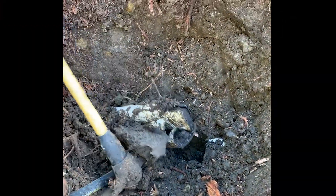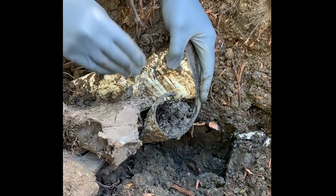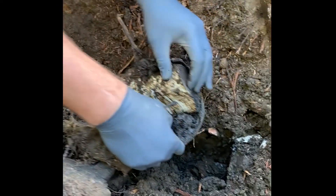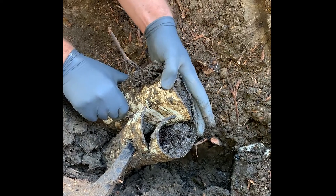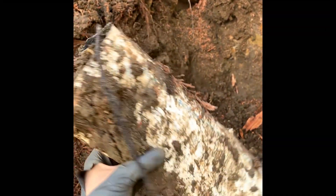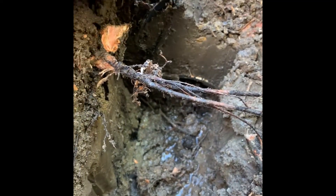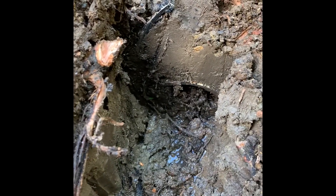Okay, this is a storm drain, and you see how it squishes. When I look at this pipe it looks like a two-inch pipe — but it's not, it has to be six inch. This is originally a six-inch pipe, but they smashed it completely. This is how it looks: a six-inch storm drain pipe under the tree. Here is the top of the pipe — this is a crack, smashed completely, with just a little bit of hole left.